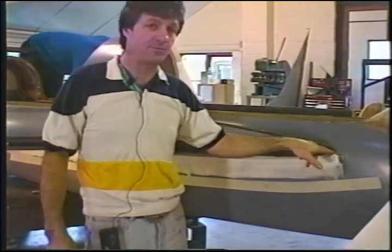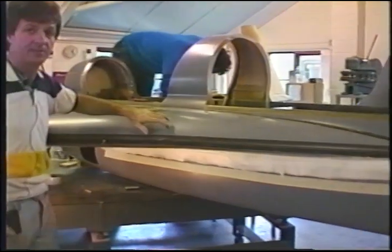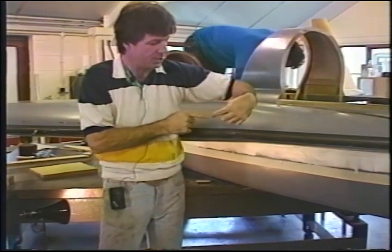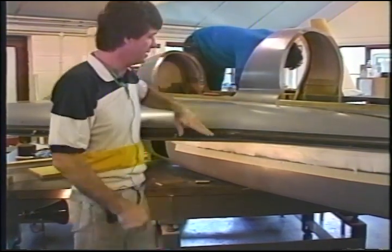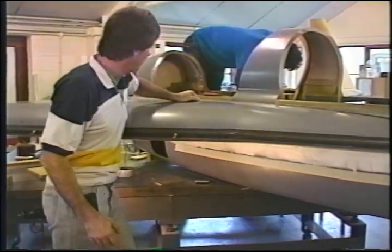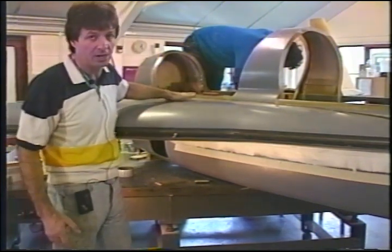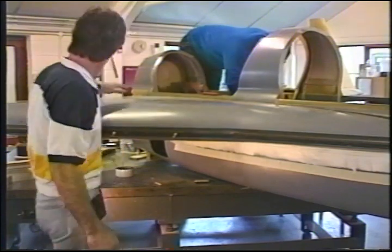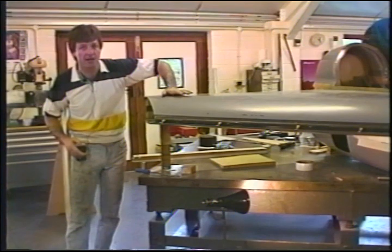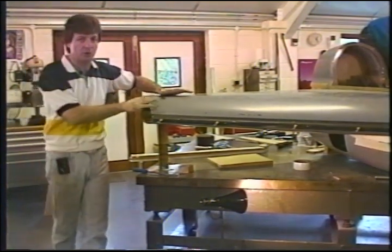Now, this point is fairly well fixed because you know it's symmetrical to the opposite side. And you go to this point. This is the only variable. It can shift in this fashion. So when you get everything bonded in place and you discover that you have an eighth of an inch before you touch the rib that you knew touched before in a no-load condition, you look at this outboard end here and you discover that you've got, oh, an eighth of an inch or so to push down to make contact.